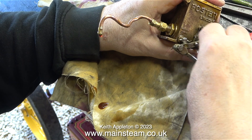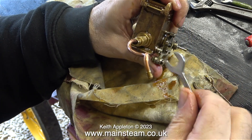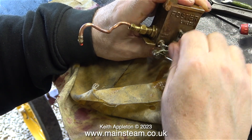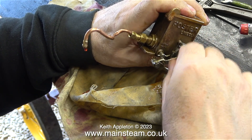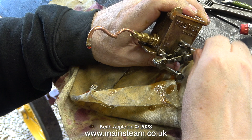I needed to repeat the process of adjusting the pump. You have to get the feed of the pump perfect. Too much oil is not really bad for the cylinder — in fact it's probably quite the reverse — but the combination of oil and soot coming up the chimney is definitely not good. The main problem if the pump feeds too much oil is the tank empties prematurely, and then you don't have any oil at all. When I first bought this engine, I couldn't believe how quickly the tank emptied — about every 15 minutes — which is why I took it all apart and modified it. Even with the blockage, the oil level was going down in the tank, so the cylinder was getting some oil, but not really enough.